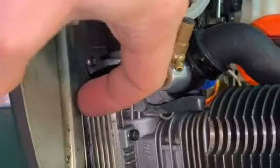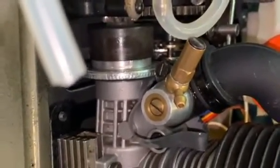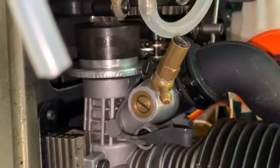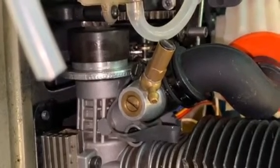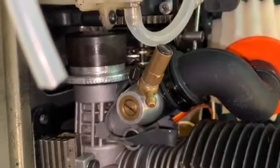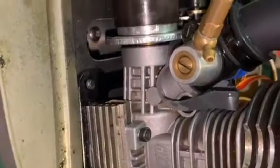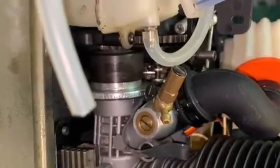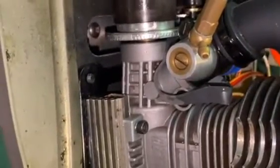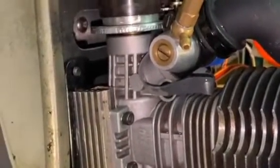All I can think is that if we get a drill and drill some 2.5 millimeter holes — maybe one there and one there, or even just one in the middle — and then put a 3mm screw or a 3mm set screw in there, that should be enough to stop this from moving. That's my theory; I've never tested it. You could do it on this side because that's the side the motor always slides away from.